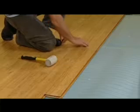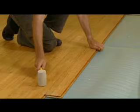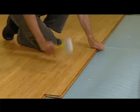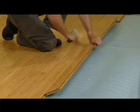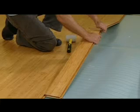Removing the panels. If there is something wrong with the panels, then you should remove it. Using your left hand, pull up the panels you want to remove. Meantime, tap slightly the area which is close to the joint point of the previous row until the lock loosens. Pull up the joint area of 2 panels slightly and lay down. Then the 2 panels detach easily.